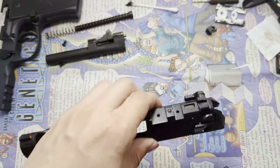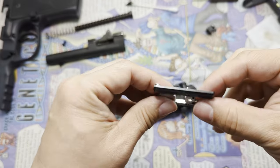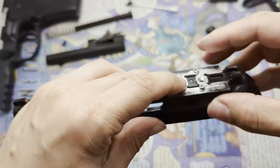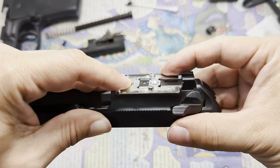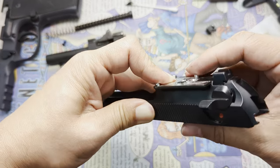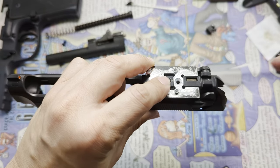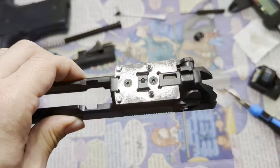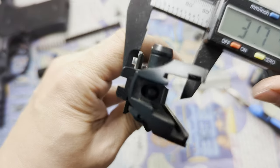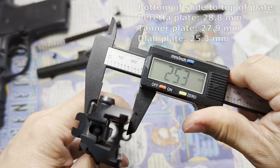Alright, I've changed the firing pin block. You can see this one sits recessed a little bit, and that's good because the plate — you can see I've gotten the edges there blackened — sits right on top of the slide. There's no extra height added, so that's really as low as you can get. After I put the screws on, I'll give you a measurement. Here's the plate installed — it's about 25.3 millimeters. That's a huge improvement.